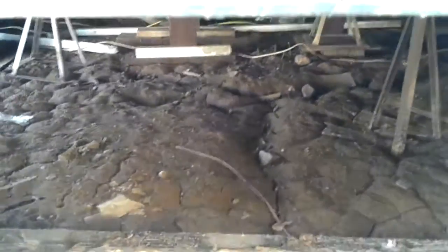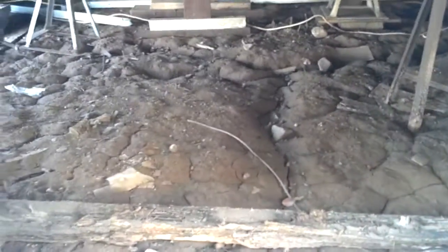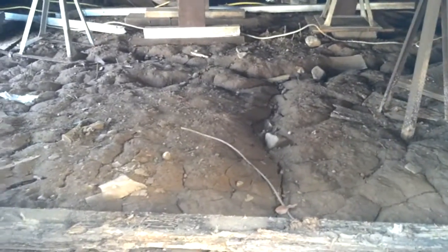As I pull back here a little bit, you can see that the water's been draining underneath the mobile home and it's damp underneath here — and that's kind of the key. One of the reasons that we have the termites is this excessive moisture.